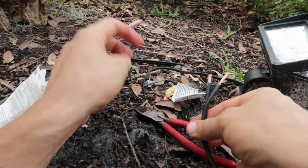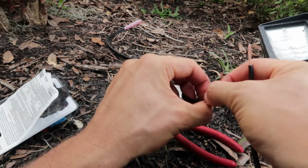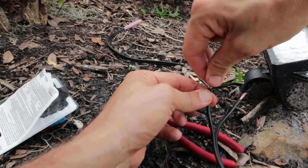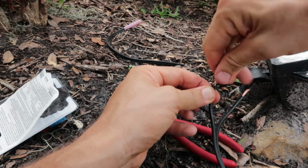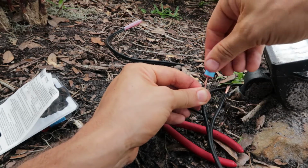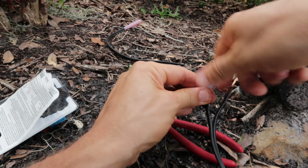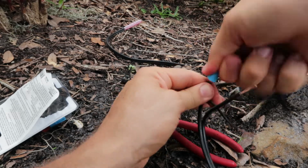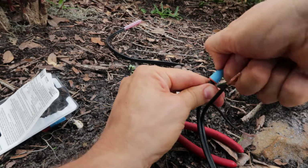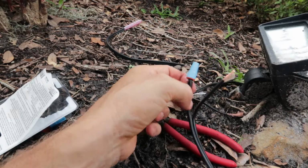Okay. All we need to do now is match up the wires, like I said, so we know that the letter side goes to the wire with the groove on it here. That's just this particular scenario. Go ahead and give a little pinch to the wires, kind of start them together. Then I'm gonna take my wire nut here, stick it over the wire, start twisting. As you twist, you can feel the wires catch. And then keep twisting, keep twisting. Let it get nice and snug. And there we go, and you can see some of the gel came out, and that's good because that's coating the wires. Good deal. So now I go to the other side.